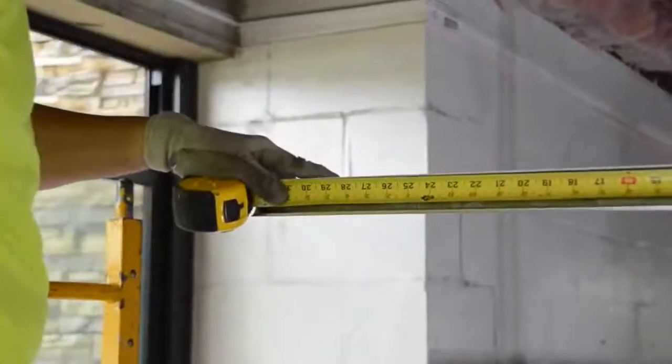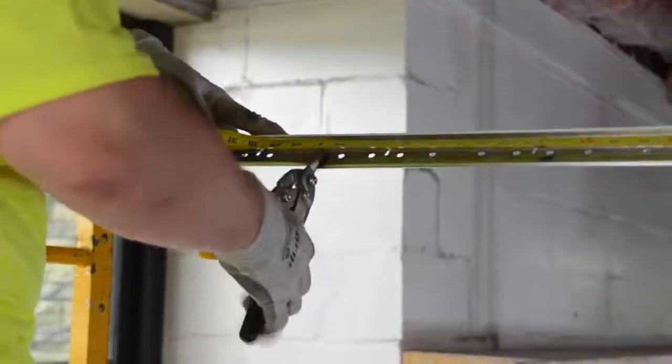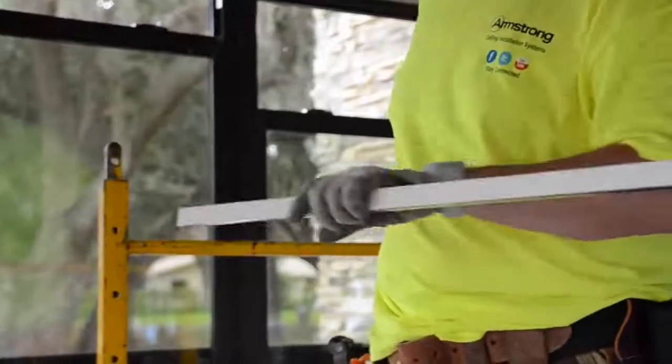This is important. We will repeat measuring from the dry line to the wall for each 4 foot on center starting main runner that we install. After that, mains will continue on as full-size main runners that always end within 3 inches of a hanger wire location.